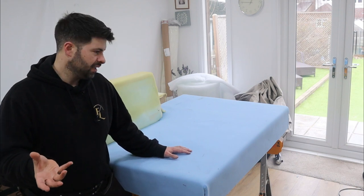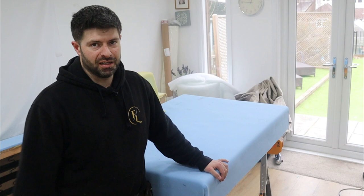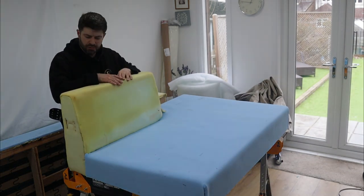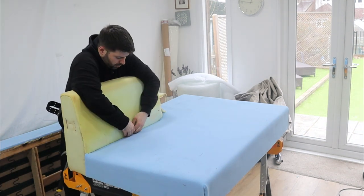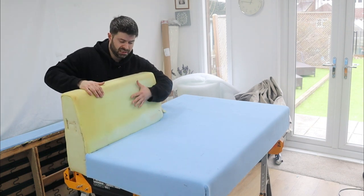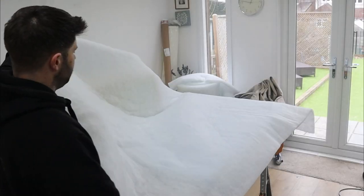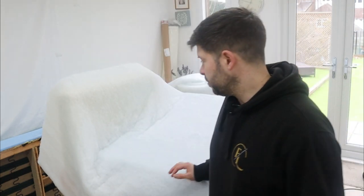That's something you won't see with a lot of manufacturers nowadays, especially the cheaper ones — that's how you can tell the difference between high quality furniture and non-high quality. You'll notice cheaper pieces will have hardly any springs and nothing over the top of them to protect them. We've got half inch blue over the top of that on the backs. They had notched out all this wood, so we've replaced that with a rail that goes all the way across, and we've replaced the rail at the bottom. Rewebbed the backs, added hessian — so that is now a higher quality bit of furniture that should last for years. You obviously can't tell these things when you go and buy a sofa. Even some of the more expensive manufacturers I've worked on — I open it up and I'm like, wow, how many corners have they cut? Even some of the high-end luxury manufacturers that most people in this country like to go to — they cut corners too. We do not cut corners. You want a bit of furniture done properly, come to us.